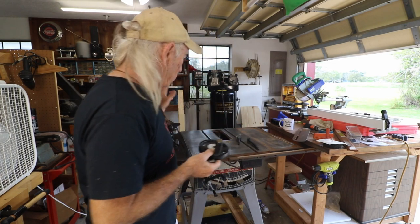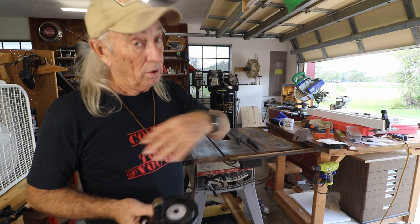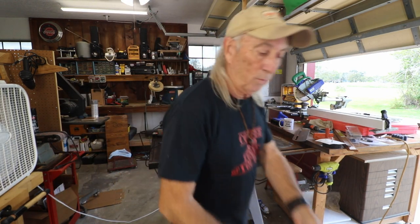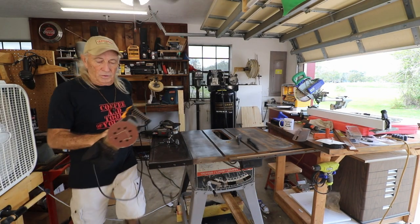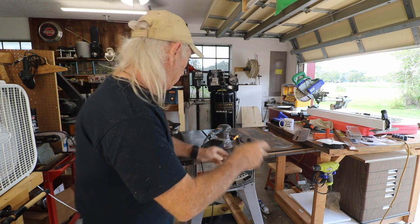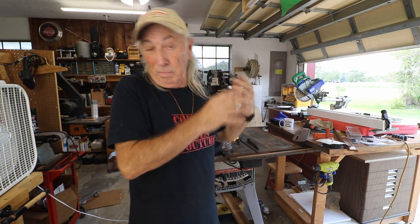I'm not so sure it's a good idea, but I did want to show you how we're going to get the rust off of here, and you can see almost all the rust is gone right now. I've got a little bit of edging and finish work to sand up, and I will be using my favorite little sander. To sand these edges, we'll be using this one to do a final sort of finish sand — I'm going to be using like an 80-grit to start with, then drop down to 120 and then maybe 200 or 240, somewhere in that range to finish the top of the saw right before we throw some nice wax on it to kind of seal it back up.